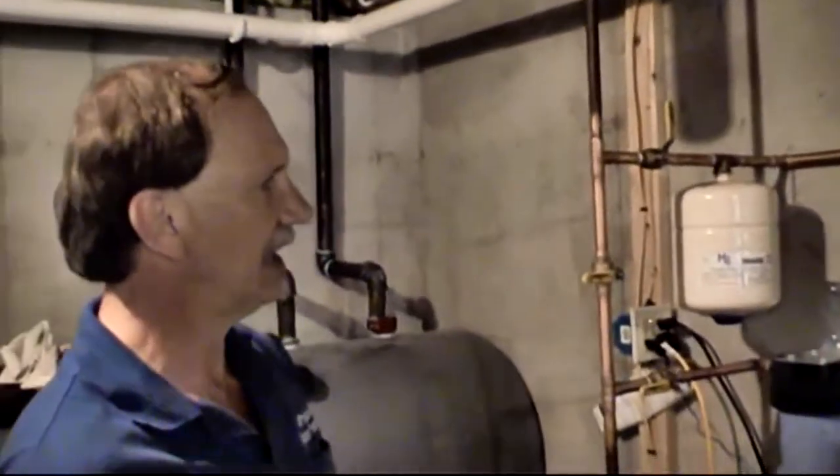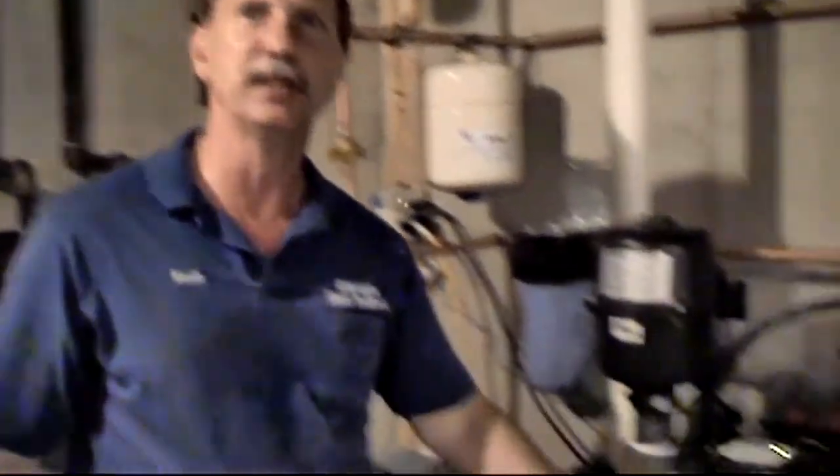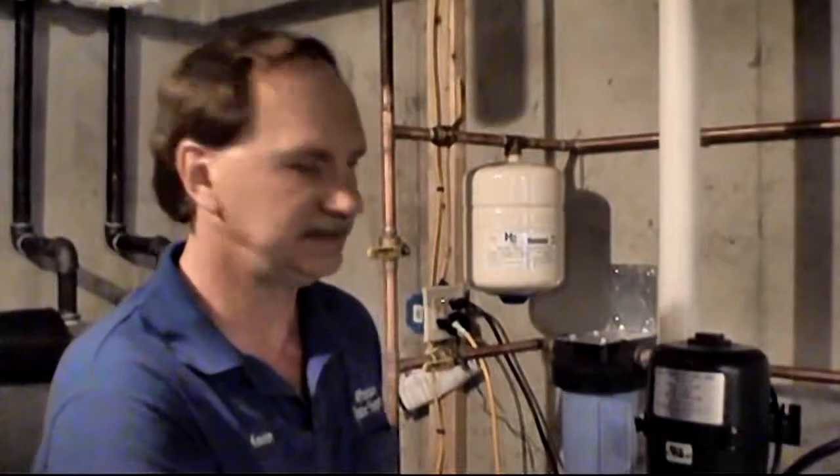I guess we kind of went over some things too fast there, Clyde, but anything else we can talk about, the efficiency of this unit, I guess. I mean, we'll do about 99 to 99.5% reduction in your radon at 7 gallons a minute. If you're getting a little more than 7 gallons a minute coming in, your reduction will drop a little bit, very little. That's about it, I guess, for now.